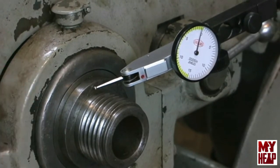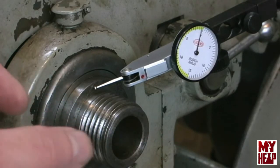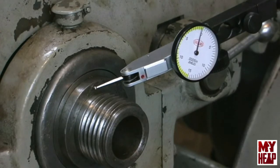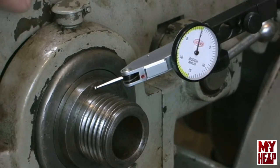Now if you do have end play in your spindle, remember there are tapered roller bearings in the front and the back, and there's a collar that screws down to take the end play out — it puts the bearings under compression. Once you have the perceivable end play out, you preload those by about a sixth of a turn. If anybody knows the specific preload for tapered Timken bearings in the headstock, let me know. Also remember this machine is cold and things will heat up and expand, which may affect the end play.